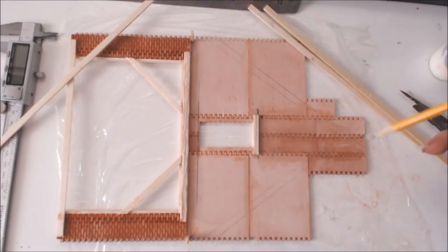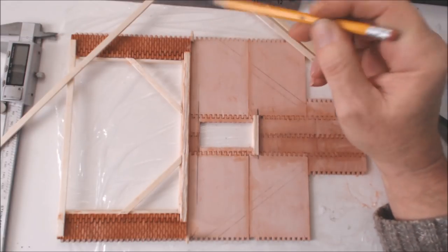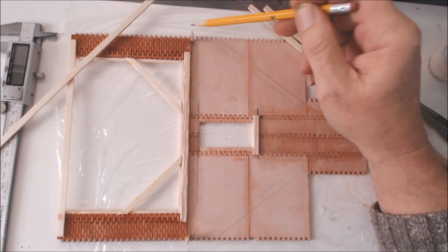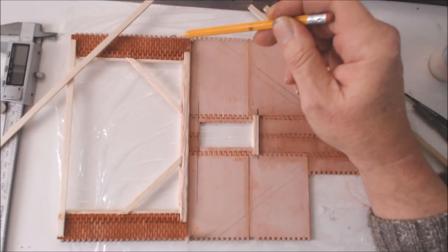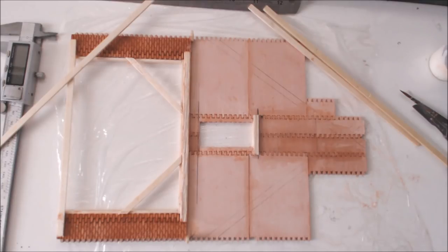This means we've got to extend this brickwork to make everything fit. I'll show how to do that later once the building is put together. We'll extend it in a corbel fashion down, so this end actually sticks out and covers the whole end of the roof - very similar to what you see on churches where the front section has little wings that stick out either side, which hides the guttering and edge of the roof and gives the front a nice finish.